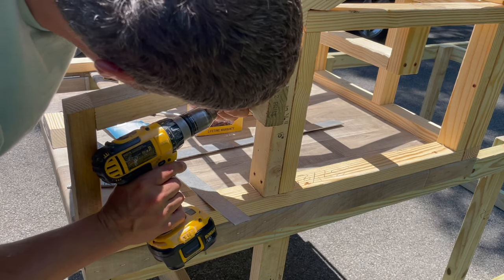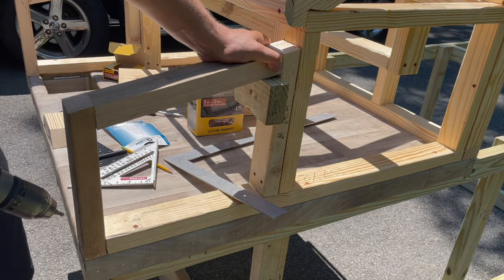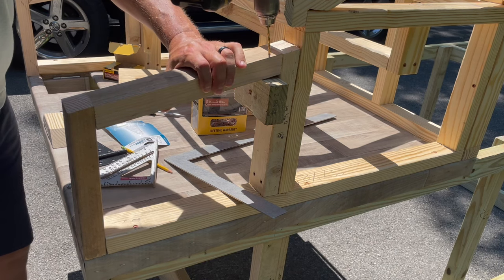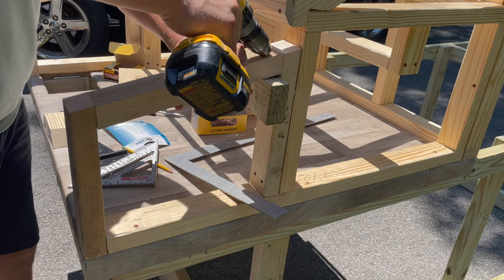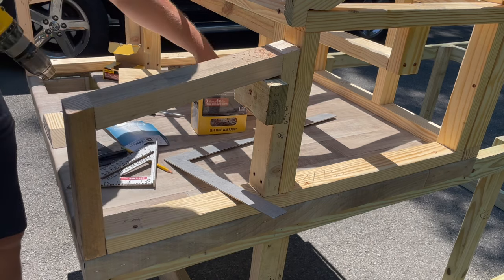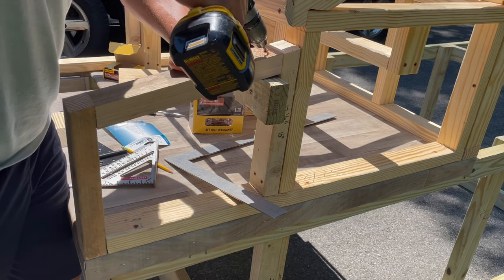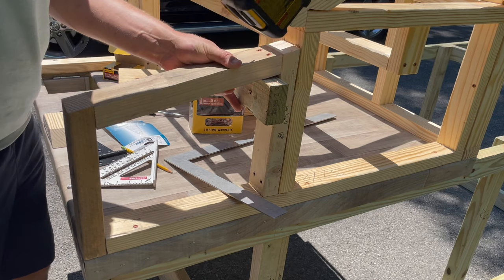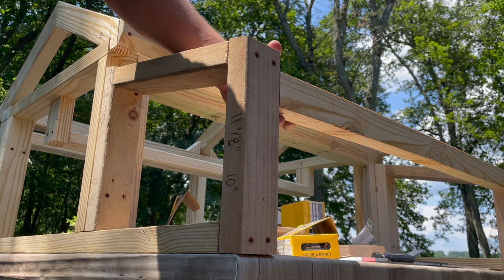In this shot I'm attaching a little block of wood underneath the last framing piece of the nesting box so that when I go to screw it down, it doesn't keep sliding down the piece of wood I'm attaching it to. What you'll see me do is pre-drill straight in and then angle it to make my diagonal drill hole. If you try to go in diagonal right off the bat the drill bit just wants to keep sliding across the piece of wood. So I go straight and then diagonal. Throughout this coop build I use blocks like that - especially building by yourself, it just helps give you almost another hand.